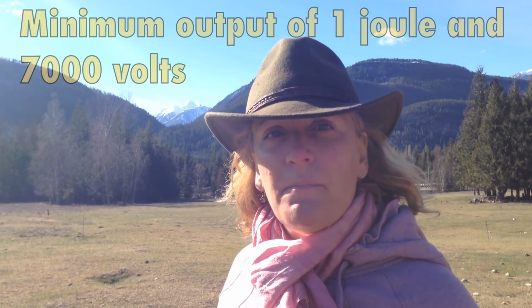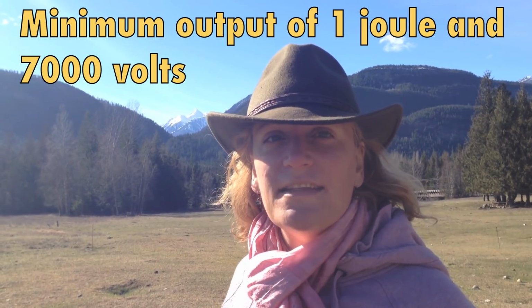Even for bears who have killed livestock, I have been able to deter them from remaining livestock with the installation of electric fencing and a strong shock to the nose. For the purpose of this video, I'm not promoting any one brand of electric fencing equipment. There are many decent brands on the market. However, when selecting your fence energizer, be sure to have a minimum output of at least 1 joule and 7,000 volts.